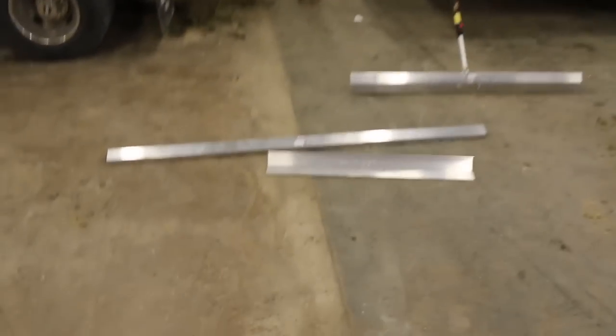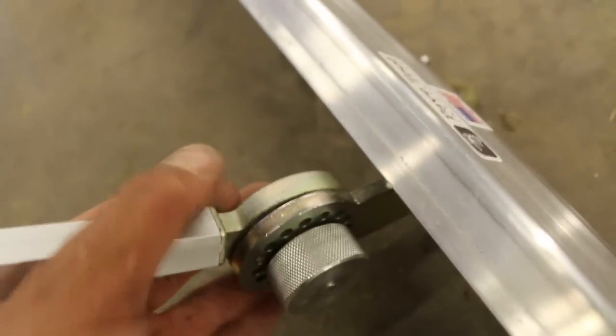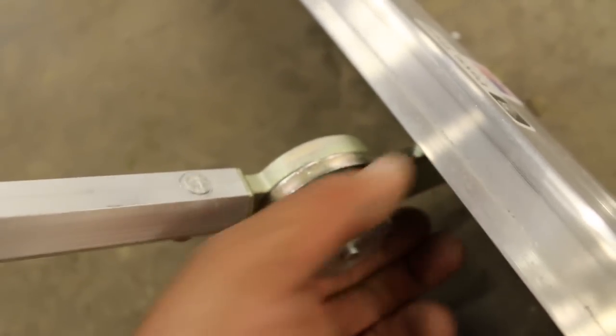Then you got your six-footer which you'd use on your patio. This will make things quicker rather than using a two-by-four and getting down on your hands and knees. It's got some wing nuts and bolts welded on to the handle piece, so you can pull your wing nut off and swap out your blade or head. There's also an adjustable piece for the handle — you loosen it, break the pieces apart, adjust it, set it where you want, tighten it back up and you're ready to rock and roll.